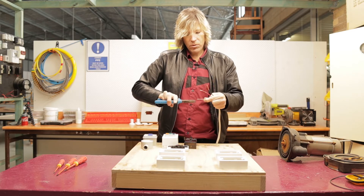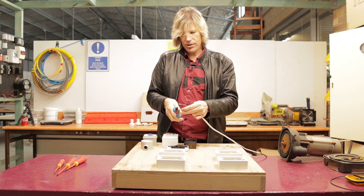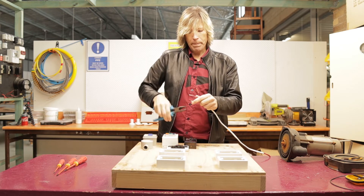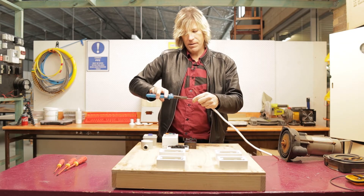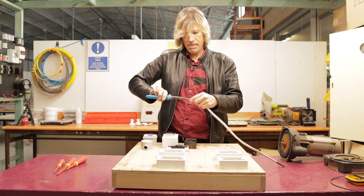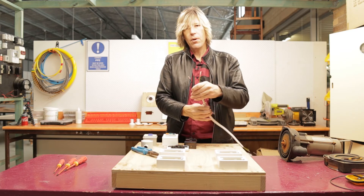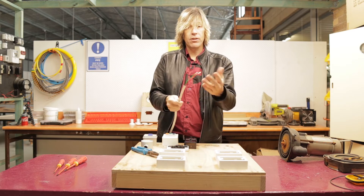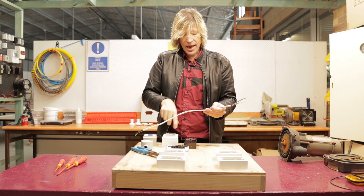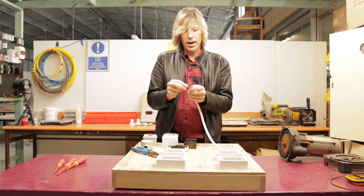Because I am only wiring up one single GPO, you will notice that I am not connecting any other cable. I am literally just going to twist and fold this cable over. I have now prepared this cable ready to terminate into the GPO. However, this other end is going to need to go into my RCD and into my earth point, so it is going to need to be a little bit longer because they have to split and go other ways.